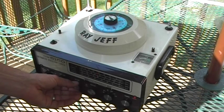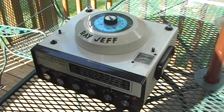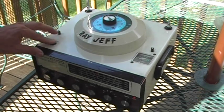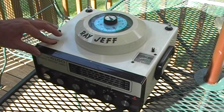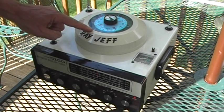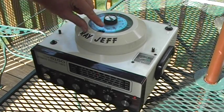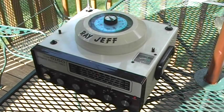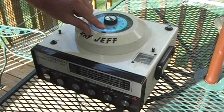As you can see right now, I've got a station. I'm up above New York City. If we put it to Automatic Direction Finding and get the antenna started, the antenna moves automatically until the diamond points to New York City, which is about 210. I set this to 40 degrees — I'm at about 40 degrees here — and it moves to 210.